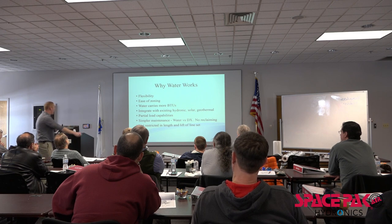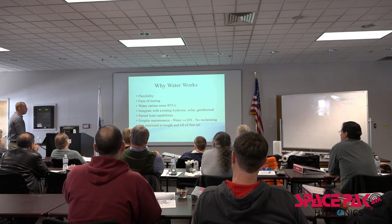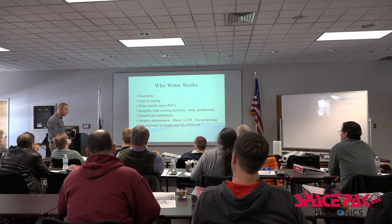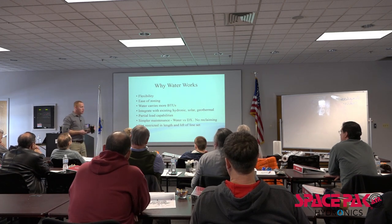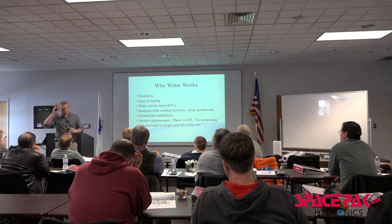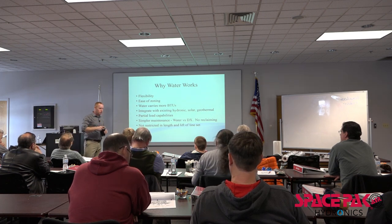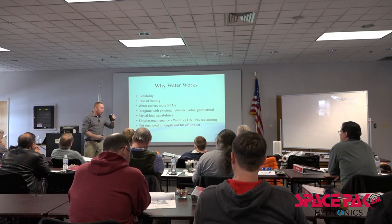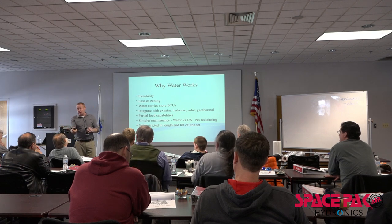Why water works? Again, because it's flexible. We have an ease of zoning. Water carries more BTUs, you can integrate with existing hydronic, solar, and geothermal systems, which has been huge. We've got some projects where we've got photovoltaic solar, PV solar in the yard, we've got water solar on the roof, they got tanks down in the basement, and a boiler, and our heat pump sitting outside.